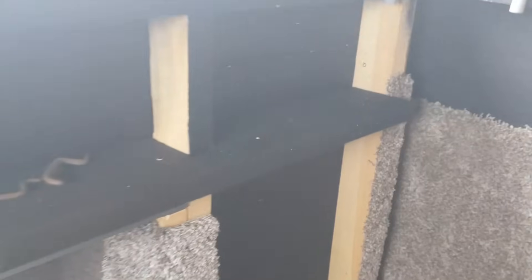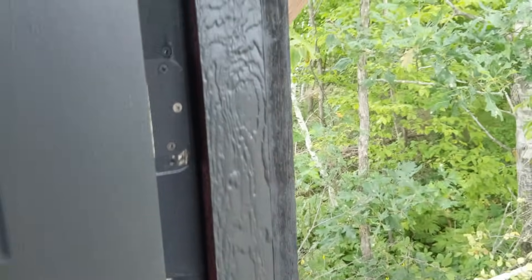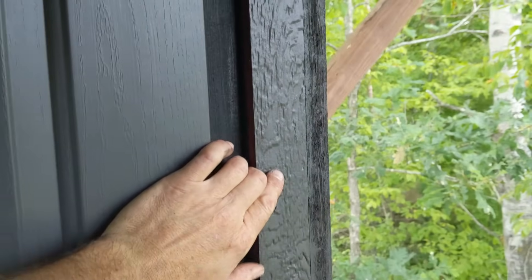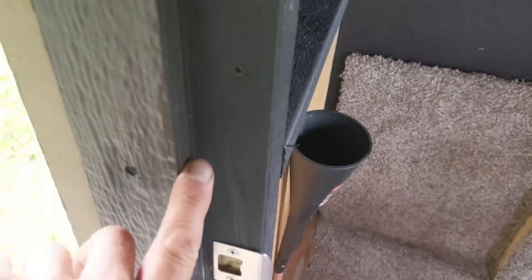Under the windows I put some shelves wrapped with landscape fabric first, so I've got room to set my coffee or maybe beer — if my dad comes out, we'll both be drinking beer. The same trim goes for my free mobile home door here — I screwed the hinges to the 2x4 frame and had some LP Smart siding trim so there's a ledge on the inside. I put a strip of rubber from that garage door stop along the door with some silicone to help make a seal and maybe make it a little quieter when closing.